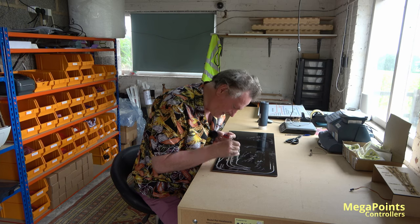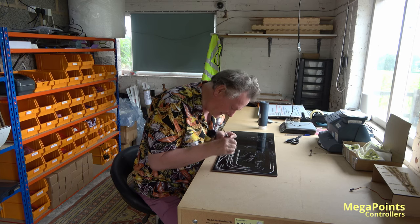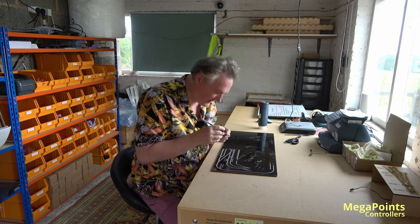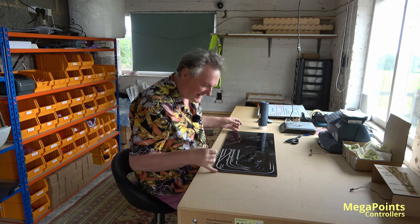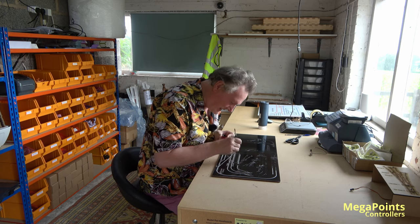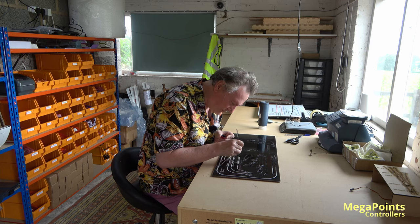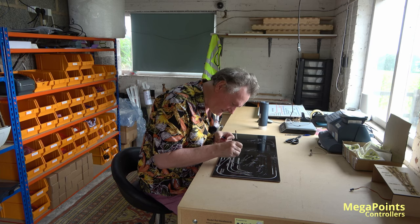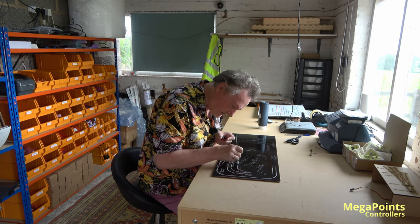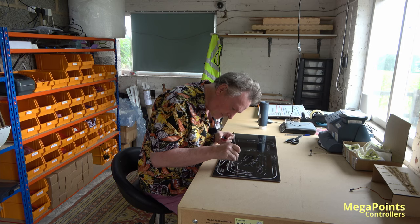But on this, what you'll see when it's finished, I've gone to the trouble to make all the switches on their own caddies, mounted from underneath, so that you could remove a single switch without having to take the panel apart, just from the rear. The LEDs will just pull out the front there, push fit, and the switches are rear mount, but you can take any one out without having to take the fascia out of the panel. It's a lot of extra effort to go to that trouble, but I think it's worth it should the unthinkable happen and you have to change the switch.